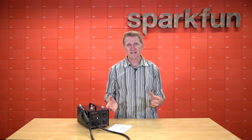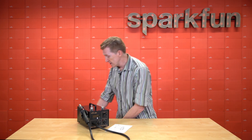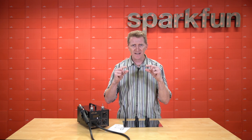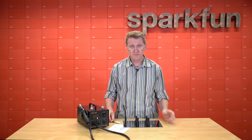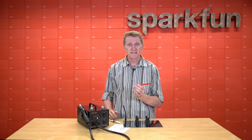As the name implies, this is the ideal tool for reworking SMD or even PTH solder issues. If you're prototyping a board and you find that an SMD resistor has tombstoned, or you've got an IC or LED that's in the wrong orientation, this is going to be the perfect tool to resolve that issue. There are a few other things I would strongly recommend when doing hot air rework: a helping hand unit of any kind — you can use the alligator clip type, or I use this PCBite one which I'm really a big fan of. Additionally, you're going to want some flux to help the solder flow more easily, along with a good set of ESD-safe tweezers.